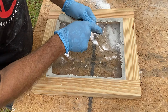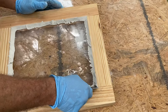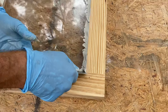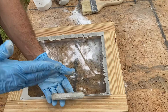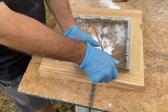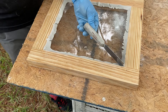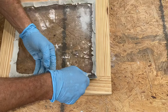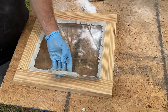You can see the indentations where I've been dragging along the wood. I'm going to stick it in the corner at the approximate angle. Here's something — I'll take my hand away so you can look at what angle my knife is at. My hand is almost going to the right — it's crazy, because everybody wants to angle it like this, steeply, and they won't get good results. My angle is much flatter like this. That's esoteric point number two.